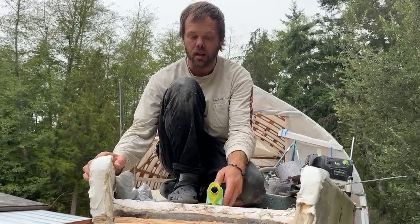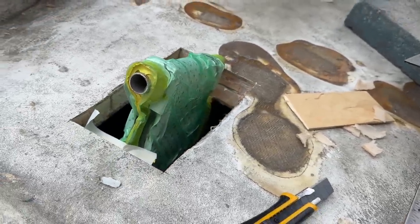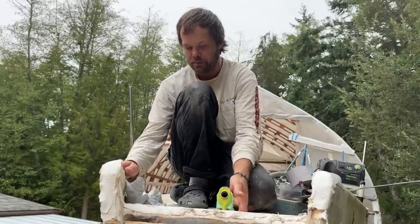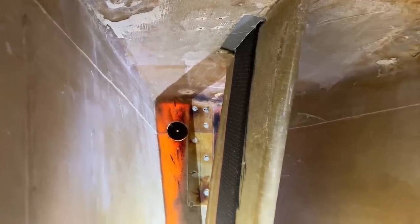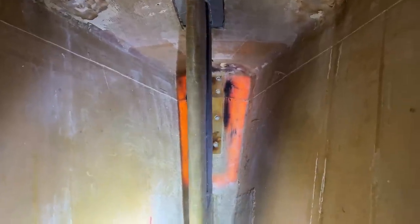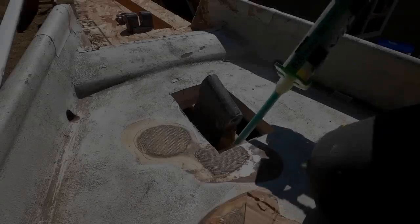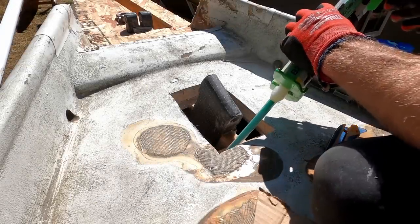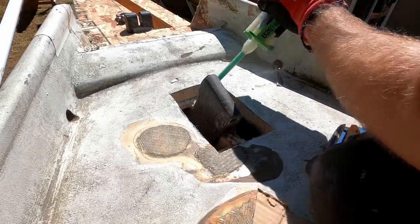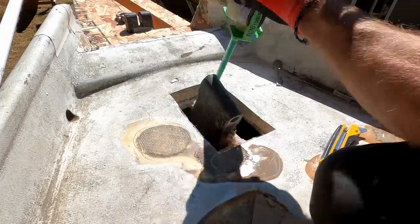So we got this done - I think it went really well. It's actually pretty easy getting the laminates on. The hard part was getting the vacuum bag on. I'm excited to let it cure and tear it off. There was a big hole in the deck where the chain plate was built, so I filled it in with some coosa board. Later I'll fiberglass over this area to connect it to the rest of the deck.